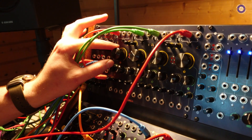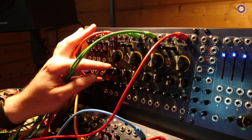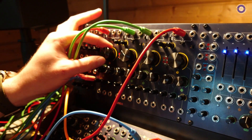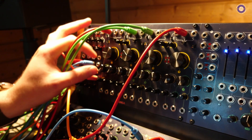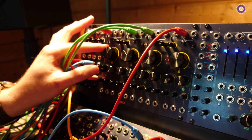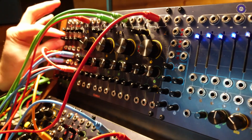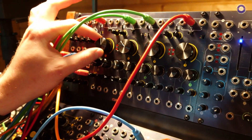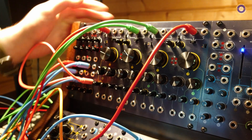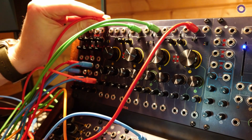Now we have no cue, no other character apart from the soft clip I was mentioning before. So even if I drive the signal a bit, you see that it stays well put. And if I add some resonance, you see that it is very clean even if I am past unity gain at the input. If I reduce the input gain through the VCA here, I can have a very liquid and clean sine wave on top of my sound, which can also be appreciated in the low pass 12 dB and band pass.